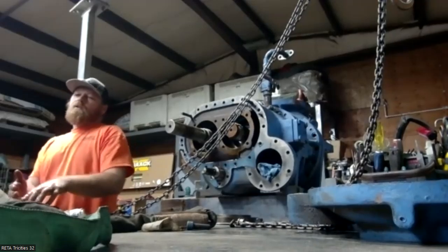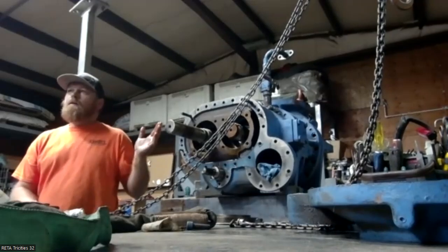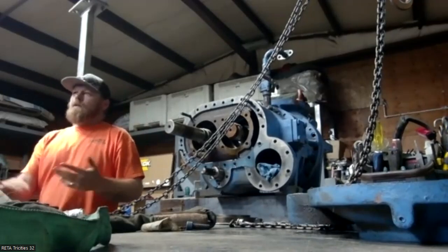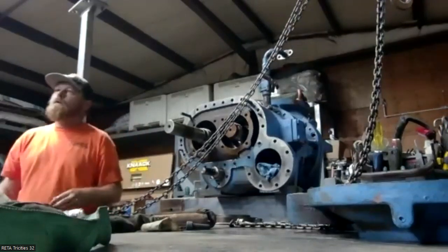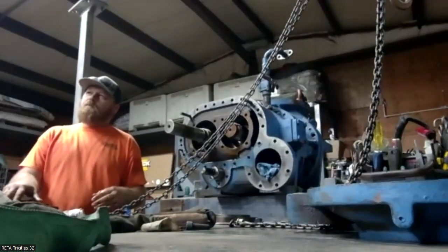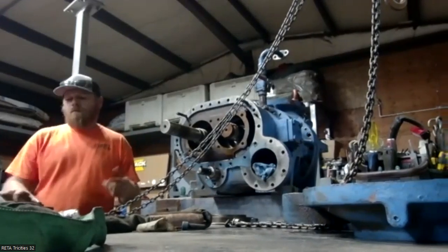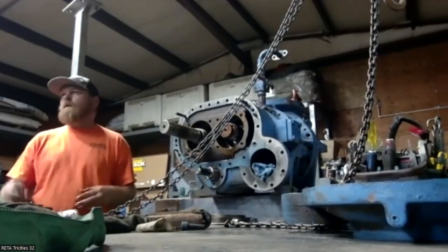And just because you took a vibration analysis today doesn't mean it can't fail tomorrow. It's just the likelihood of catching it early. A small defect in one of these bearings will cascade fairly fast. Once it starts, it's just going to keep going.